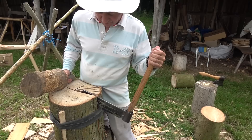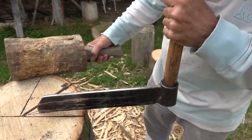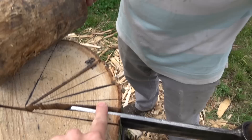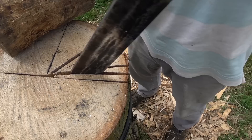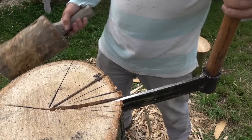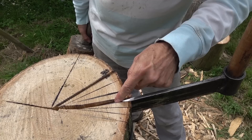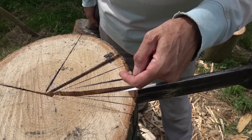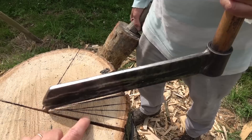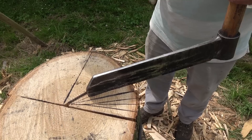These are over half an inch, and this is where a bigger log is an advantage. Now I've got to take my best part of the shingle. I take half at this point, then come down like so — that part will probably be waste. With a bigger log you wouldn't have that waste. The important thing is to do exactly the same with the adjoining one. If you don't do it this way, when you split them out you'll probably find it tapers in that direction. That is the cut you want on the quarter — and that's suddenly looking like flat roof tiles.